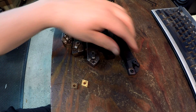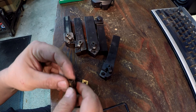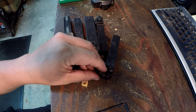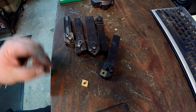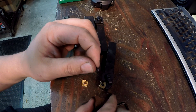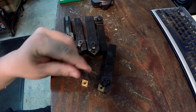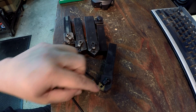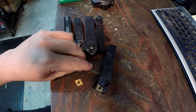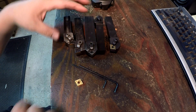One thing I want to point out — it applies to any insert tool — is the torque you want to use on the clamping screws. Here's a chipped insert that's perfect to drop on that tool and use the good corner. When you seat the insert, this is really all the torque you need: just use the short end of an Allen wrench. Out of habit most of us crank it tight and then give it a little extra, but it's really not needed. Get in the habit of just giving it a firm snug tightening — never go full gorilla torque on those screws.